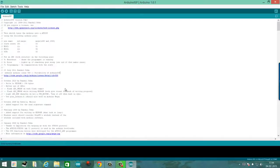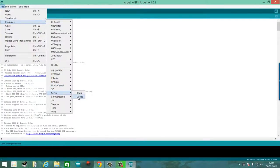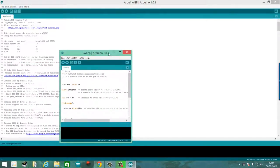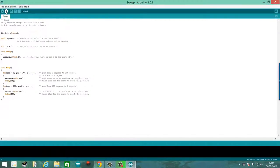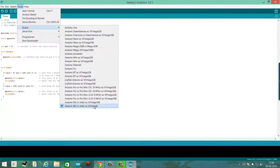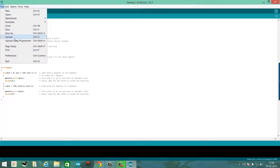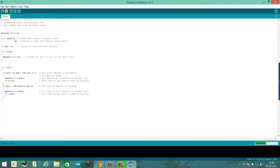In this case, since we're using the Mega 8, we'll be selecting this option. If you're using something like the 328, you should go ahead and use that option. Then double check your connections and click on Burn Bootloader. Once it's finished burning it should give you an indication. Now your Mega chip is basically an Arduino, so you can upload any sketch which works on the Arduino to your Mega chip and it will perform the same way. Let's try it with an example — go to the examples tab and select a servo testing sketch. We'll be uploading this to the board, but make sure the board is selected to the appropriate microcontroller. Then go to File and click on Upload Using Programmer. Once it's finished uploading, the program should work as usual.